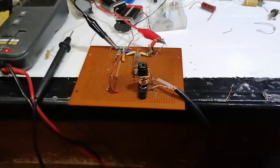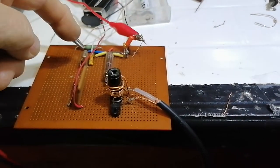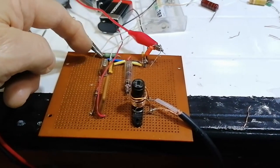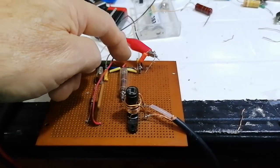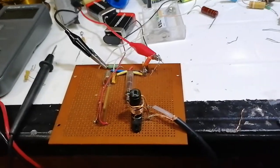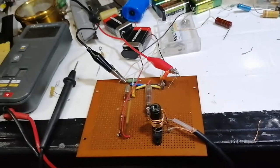I'm going to tidy up a bit more - obviously tidy up this mess here. I'm going to decouple the heaters and filaments better. There is a 0.1 in circuit, but it might need a bit more from this side, even going to the actual filament side of it, not the battery side. It cures the hooking completely, so I just thought I'd give it a little bit more. The sync tips are now fine - I've got 30 percent sync, so everything's good.